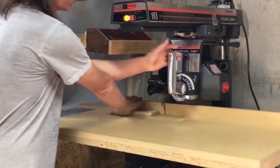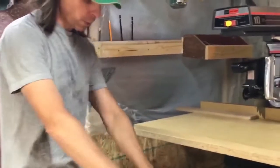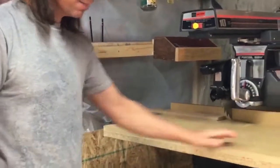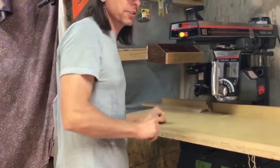And you should never cross your arms as you pull the saw through. Also, keep your work area clean — both the tabletop and the floor — especially because you do not want to fall into the saw if you trip.